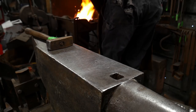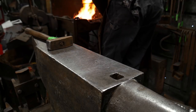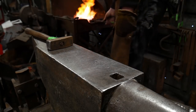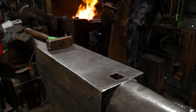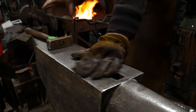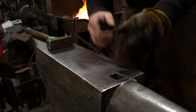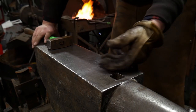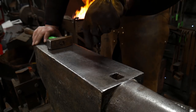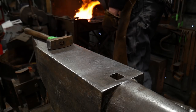We're taking a really long heat this time and painting it a little bit because I'm trying to get the rest of this scroll done in this heat so you can all see how that looks. You want to get really nice long heats at this stage. At the very end of the scroll, no matter how much scrolling you're doing, you don't want this bean pod pointed upwards — you want it dangling, pointed in the downwards position. It is very crucial that you do that.